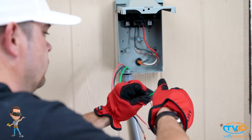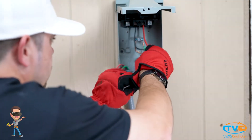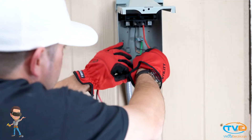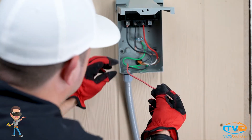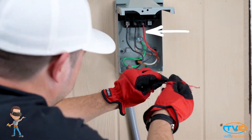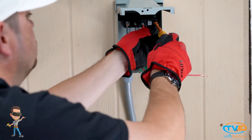That just means that you can't install any wire rated over 60 amps inside the disconnect. Next, you want to install the whip for the AC unit using the disconnect's other knockout. Then you use the green screws to connect the ground wires. Since ACs don't need a neutral wire, we will phase this wire red to indicate that this is going to be used on the B phase of the panel.